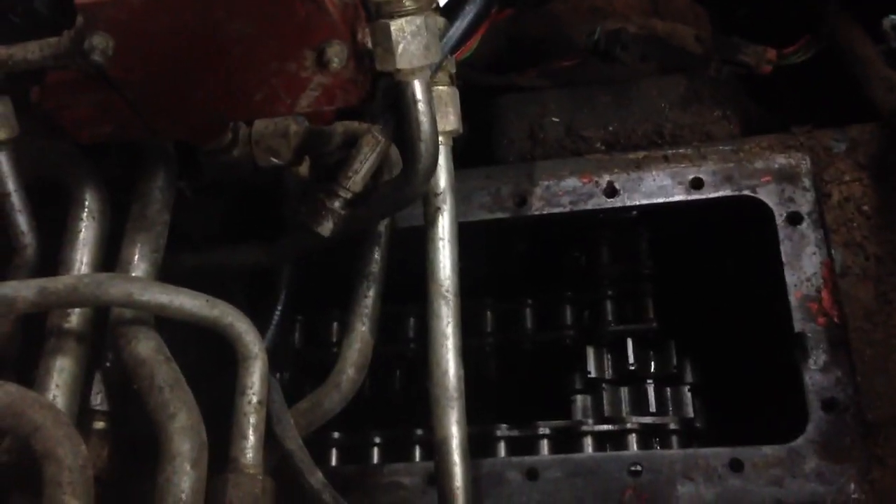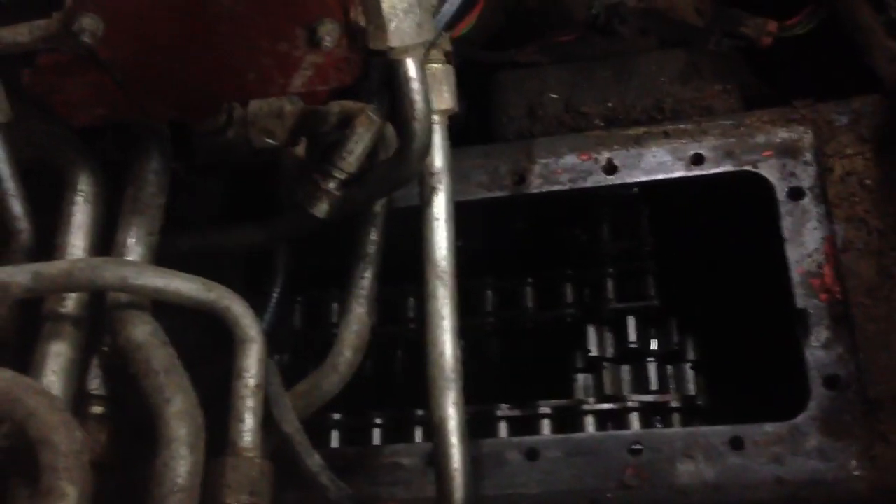The covers were off and there was no oil in the chain box. I know it's supposed to have oil in there, so I'll fill it up and use it for a while and see if it leaks. All the wheel bearings are tight, which I was happy to see. I don't know how long it ran without oil — I put four gallons in it when I bought it.